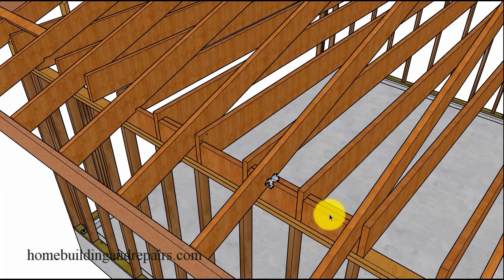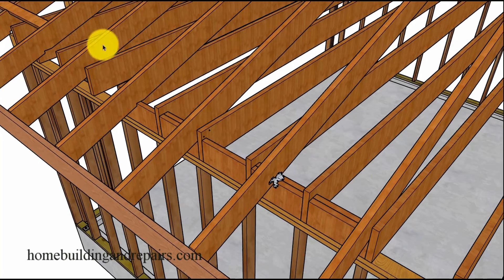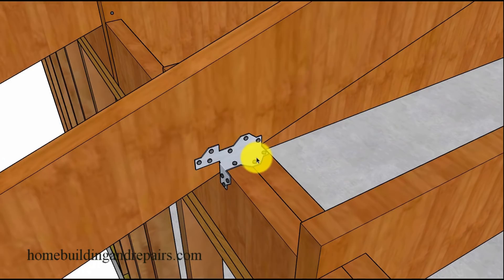Here's a panned-out view — I would actually prefer double blocks over a single block, and an engineer might like that too. If you have a difficult time nailing the rafters and ceiling joists together or nailing them to the blocks, you could always use some type of hardware to make the connection. You might need to nail the hardware to the blocks before installing them.